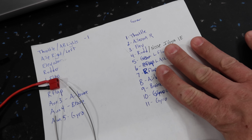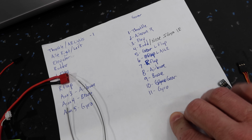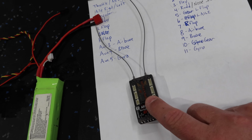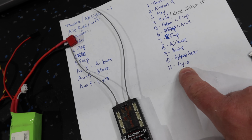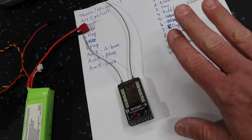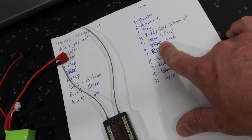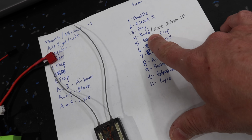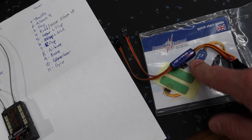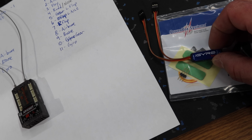So with our channel layout, we're actually struggling for channels here a little bit. So one of the things is we've got 10 outputs on this receiver. Gyro doesn't need to be in one of the outputs, so we've got that on channel 11. So that is fine. Now one thing, instead of running the rudder and nose, we're gonna pair those together. Instead of that, running that off the AS3X, what I'm gonna do is I'm gonna have a separate gyro for the rudder and nose system.